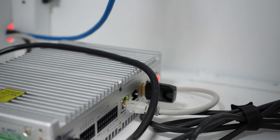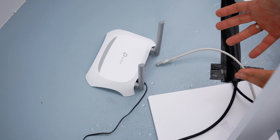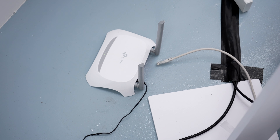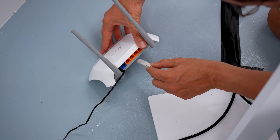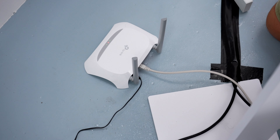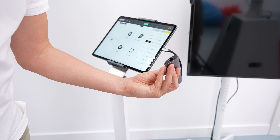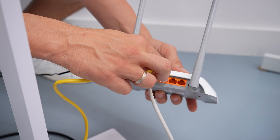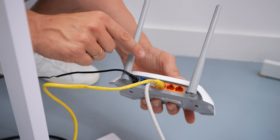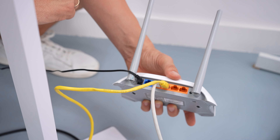Make sure to connect the LAN cable to LAN port 1 to make it work. You can use almost any router here, but please don't use travel routers because they do not allow access to a local network. Plug in the cable from the Dobot control box into the router. Then connect the USB hub to the iPad — the USB hub has an ethernet connector. Plug in the ethernet cable. Do not use the WAN connector; use the ports with another color.